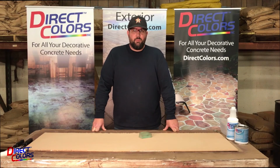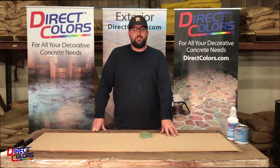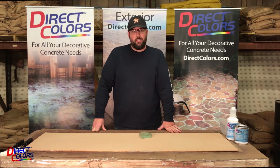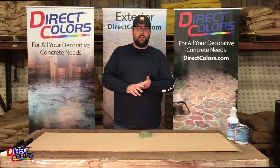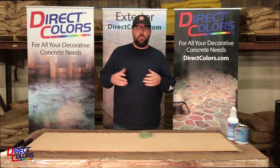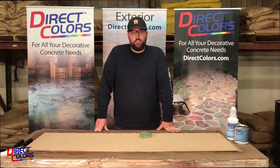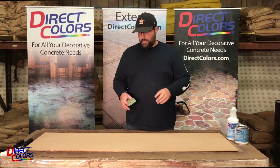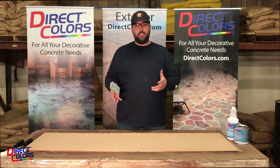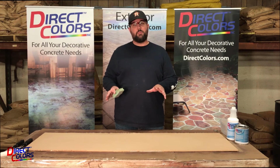Okay, we're back here with the overlaid surface that we've been working on. This was the overlay with the integral color of San Juan in it. Got a really pretty tan color. When we're looking at sanding your floor, you're either going to have a sanding screen and a floor sander, or you might be using a swing buffer with a sanding pad on the bottom of it. Probably about a 200 to a 220 grit will do the job. For this small piece right here, I'm just using a sanding block. This has set for about 8 to 10 hours. It's pretty well dried out. All the moisture is gone off of it, and this is about an optimal time to sand it.